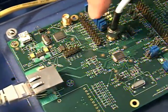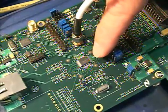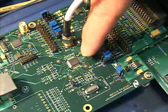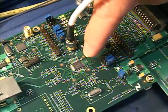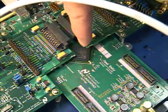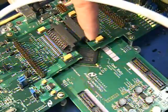With IEEE 1588, there are particular time-critical actions that happen right at the edge — right where the wire comes into the system. This is where we do the time stamping of all the packets, and that really determines the accuracy. The IEEE 1588 packets are time stamped right at this node and then sent through to the MAC. In this demo we have an FPGA acting as a MAC, but all of the 1588 components are happening in the PHY itself, and that data is sent up to a software stack.